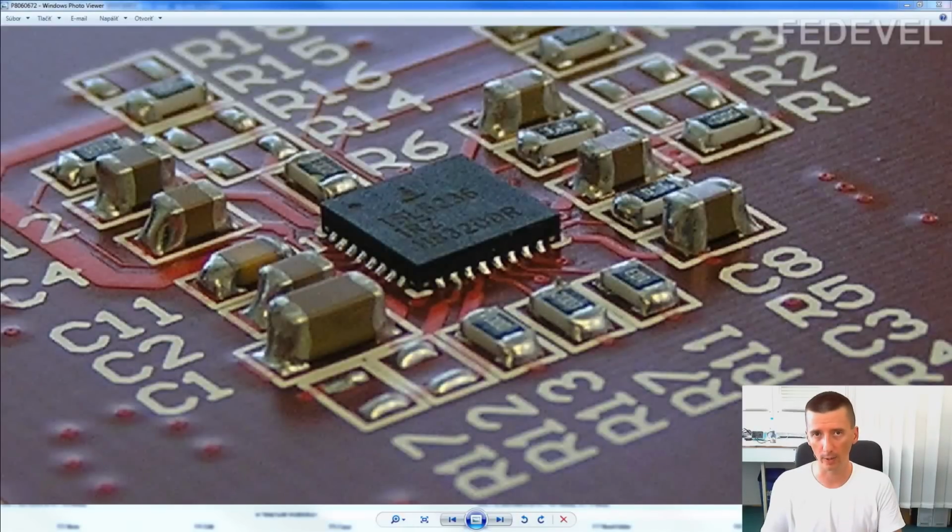The last thing I always do is go around the component and solder the pins also manually. Why? Because I've seen a lot of boards, even from production, from real manufacturers, with this kind of footprint and bad contact between pad and pin. So when you go around, you will be pretty sure there is really a good connection. And it should look like in this picture.